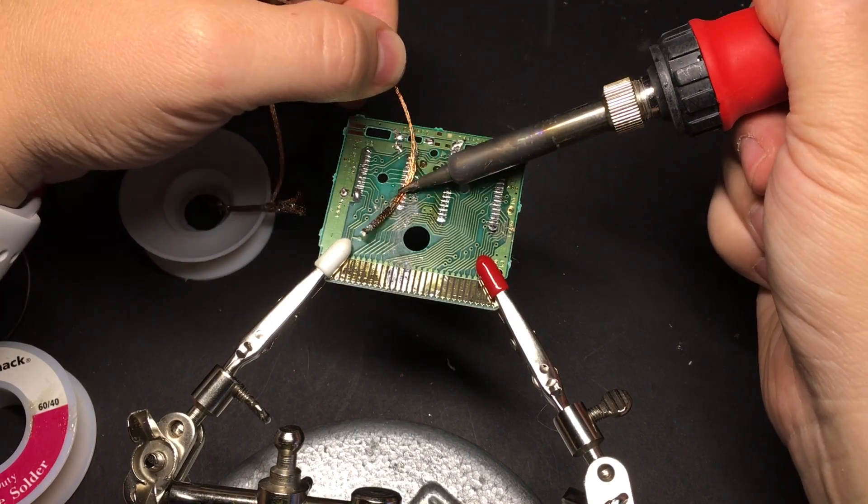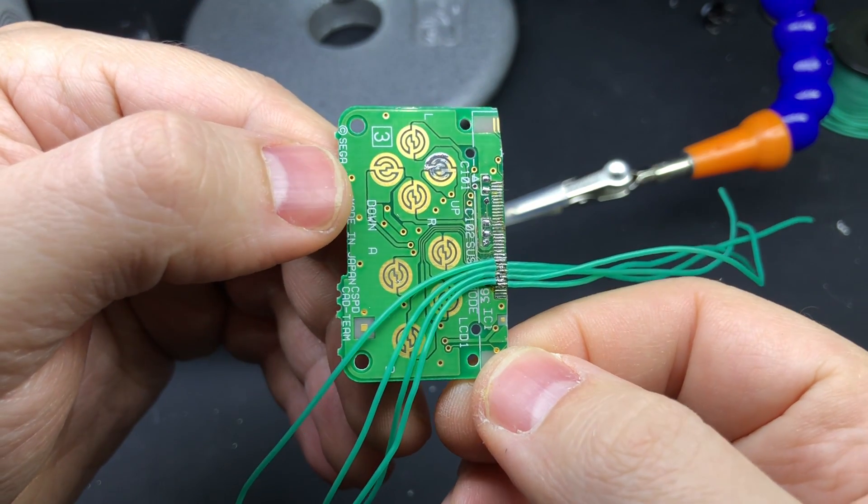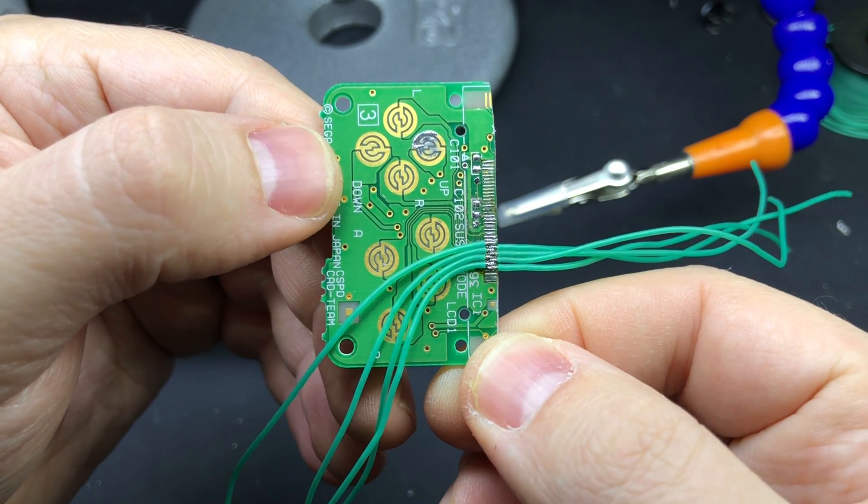The solder sucker is especially nice for uneven surfaces, like a board with a lot of components where you just need to remove a blob of solder somewhere. It'll get you about 80% of the way there for completely removing solder from a surface. To get it completely clean, that's where this comes in — this is a desoldering braid. It's basically just a stranded braid of copper wire. You press it up against whatever solder you're trying to remove, heat it up, and it will wick that solder up into itself. This is nice for removing virtually all of the excess solder from a surface. In fact, in my recent VMU build I dripped some solder onto some of the button contacts — this is what I used to remove that and make a nice smooth surface.